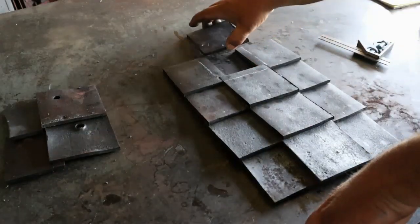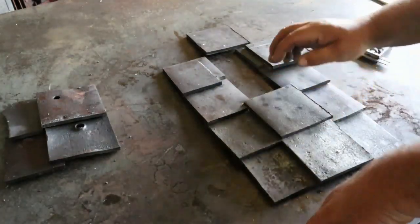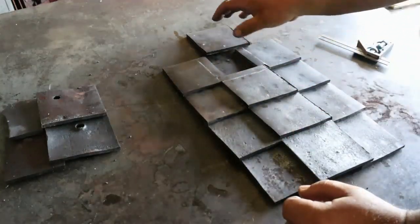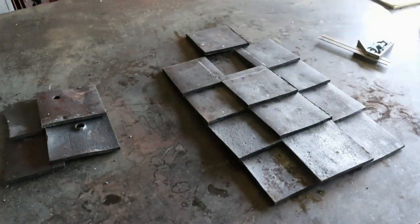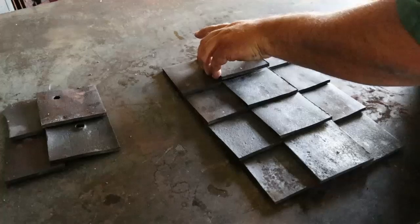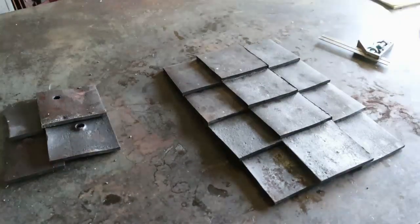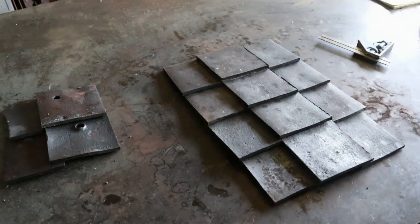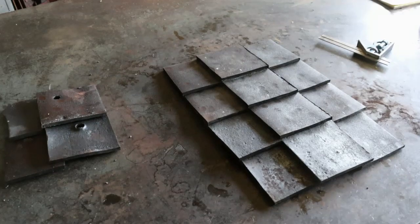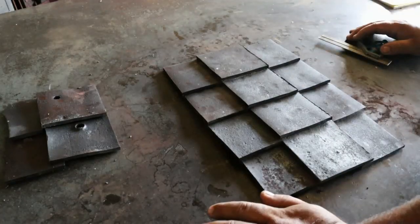I finished cutting all my notches — see there, all the way down. And I was overcomplicating this in my head. I was planning on grinding these edges down to an eighth of an inch, but the more I've thought about it, this is three quarters in its thickest spot. And if I grind those edges down while I still have quarter inch, our weak spots will be weaker. So I think I'm just going to leave it. That gives it the best chance of actually working, and it makes where we rivet it together the only weak spots.